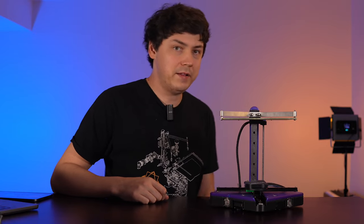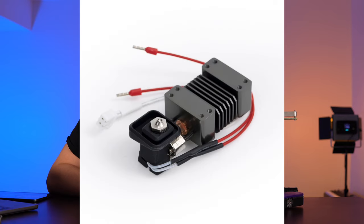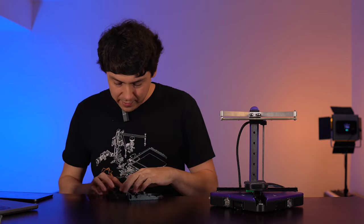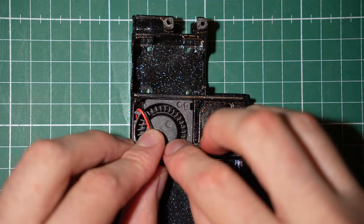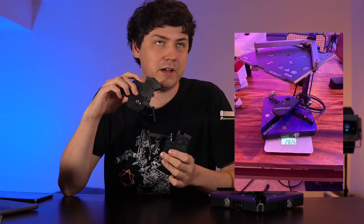I had also been in contact with Nomad from the Positron team. He let me know that LDO was going to ship hotends to KB3D.com to sell, but they'd be expensive and he wasn't sure about the final price. I was not too happy about that — I always have you in mind. But once I got the hotend, my mind was changed. I could see the quality practically emanating from its construction and I got to work. The dimensions were completely different, so I began to cook up my own tooling, filled with motivation. Two weeks later I had it perfected: 5mm slimmer than the Journeymaker toolhead, pro position optimized, cooling optimized, 3D layer stackage optimized. It's the smallest Positron-style toolhead, and if anyone's curious, it weighs 118 grams, which I'm told is pretty good.